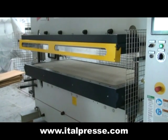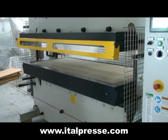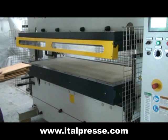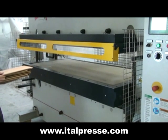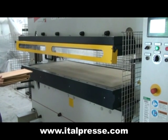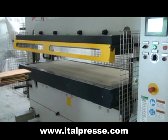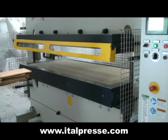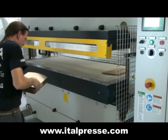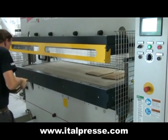Panels are loaded from the front side of the press. Typically you might put anywhere from 5 panels to maybe as many as 10 in there at a time depending on the size. There are no particular spacing requirements or balancing of the panels — they are put randomly in the press. Panels are placed profile side down against the membrane, manually placed in there.